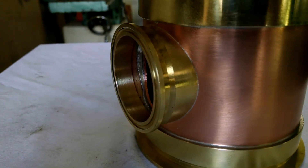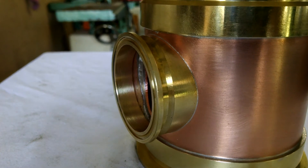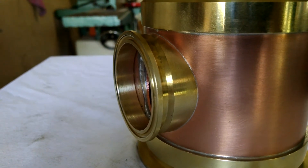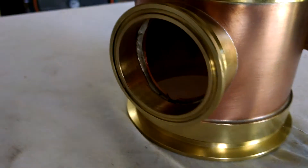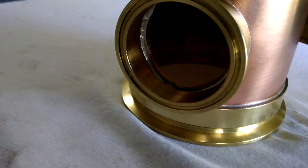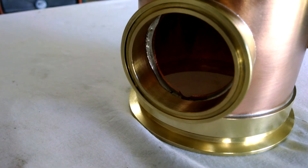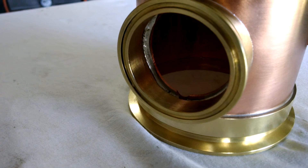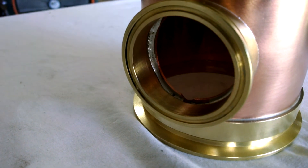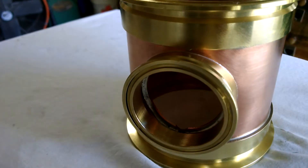As you can see where this two-inch sight glass marries the body section, how clean that solder joint is between the two metals. Inside this sight glass itself, we did add that small notch at the very bottom to give you an orientation for how that thing goes together — that always goes down. It actually allows the ethanol that sits in that sight glass to expel out of there and be processed through that perforated plate.